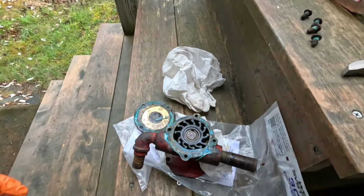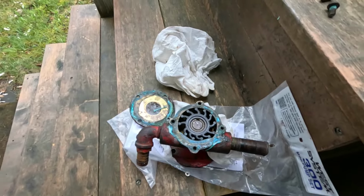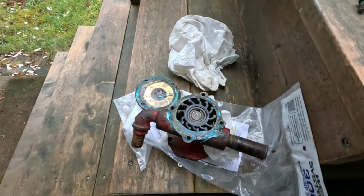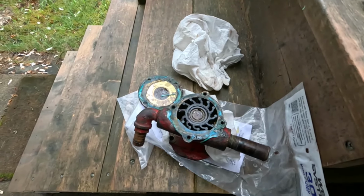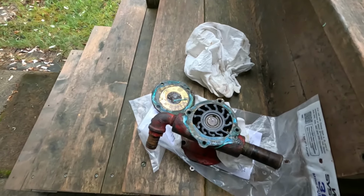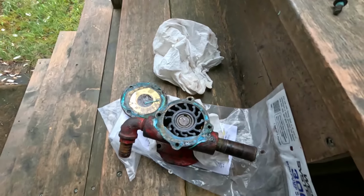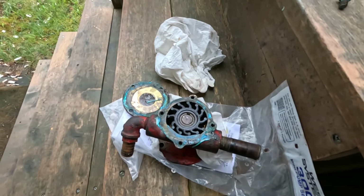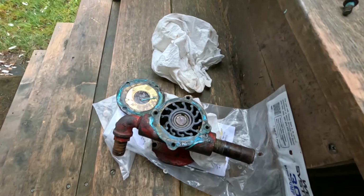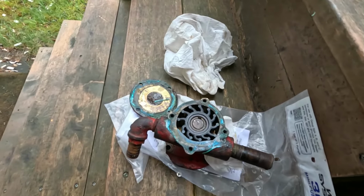And there's the impeller, and I got this video of it now to show me the orientation it's supposed to be in there. That impeller has been in there for about 10 years, and it looks in good shape. But before we can take this apart, I have to take it out. And these things, basically, you just lever them out with a screwdriver. And I'll use the picture here to show me which way it goes back in terms of the bend of the impeller blades.